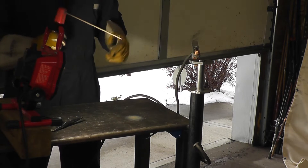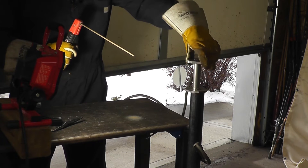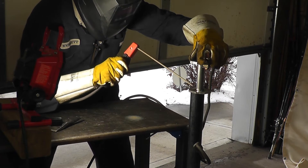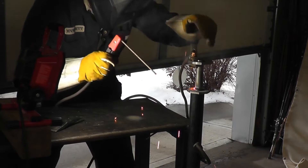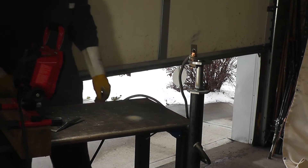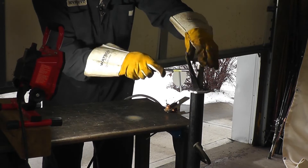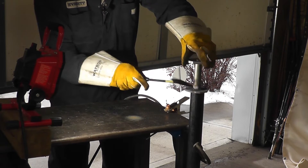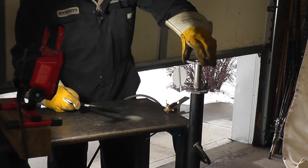I know some people will be using 70-18. I like 70-14. We're going to use 70-14 rod at about 125 amps, 1/8 inch thick rod. For not being a particularly gifted welder and not having a turntable or a positioner, that'll be acceptable.